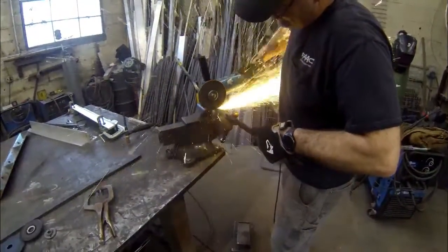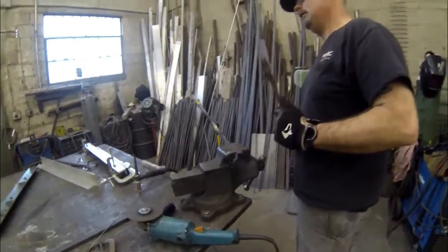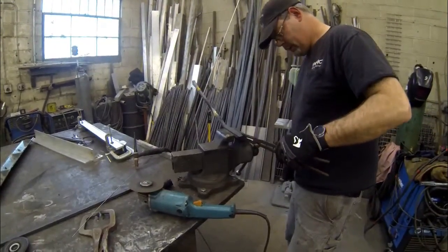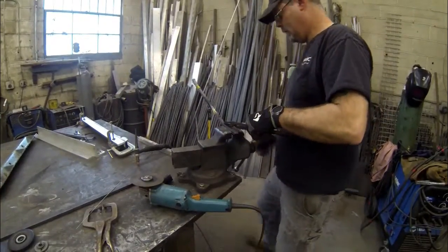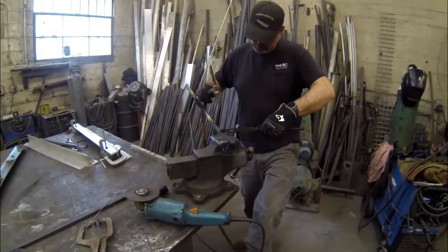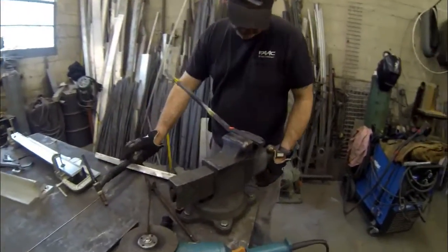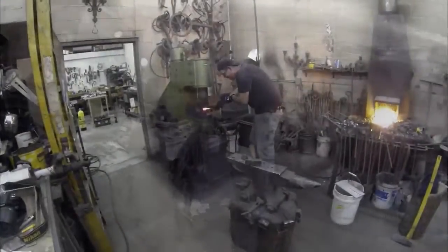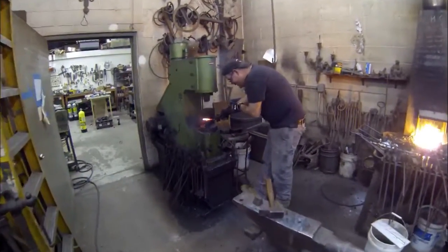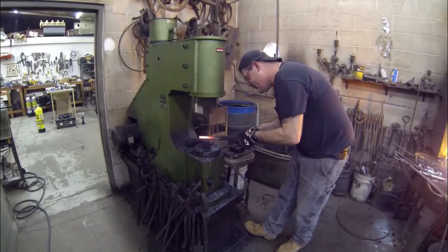He's going to use a grinder to chop off the piece, and then stack it right on top of the existing piece. Those two pieces will have to get welded together before they go back into the furnace — that just holds them together until it can eventually be hammer welded or fused. So we were at 16 and now we're at 32 different layers of material, and each one of those layers is now paper thin.